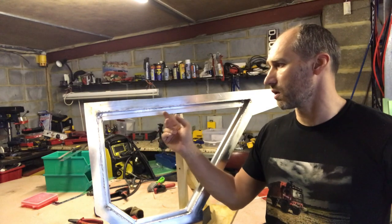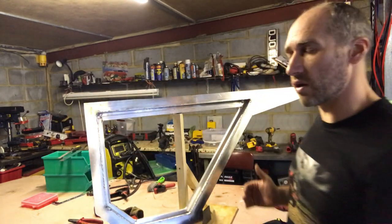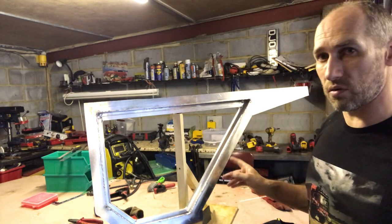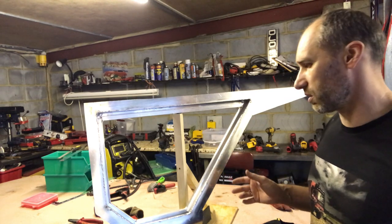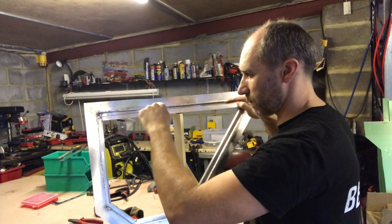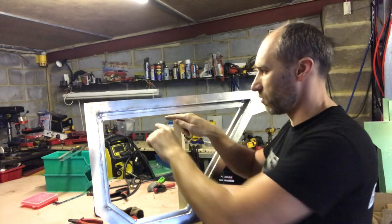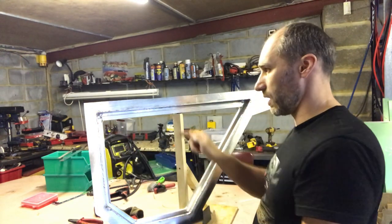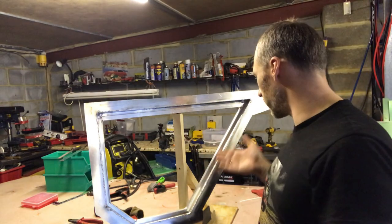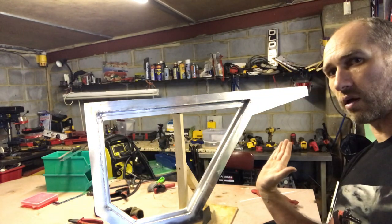Now that the guttering is on, I'm going to build the rest of the box - cut the top, sides and the bottom - so I can weld and finish this box. The door is going to get the edges folded - a flat piece of aluminium with sides folded - so they go into here and engage with a neoprene seal. It's probably going to be hinged on this long face here so the door will open outward.